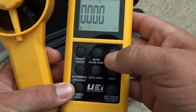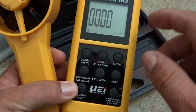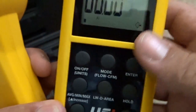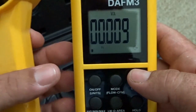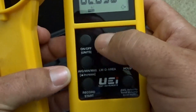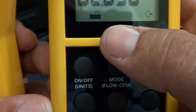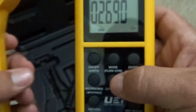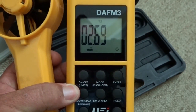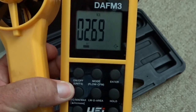Now I have that, and there are different measurements. There's a length and a width if you're doing a square duct, but I'm going to go all the way to area — hit it twice and you'll see foot squared area. That's what I'll be doing, and there's our measurement that I'm using for this grill. It's already in there, and I'm going to show you now where I got that measurement.